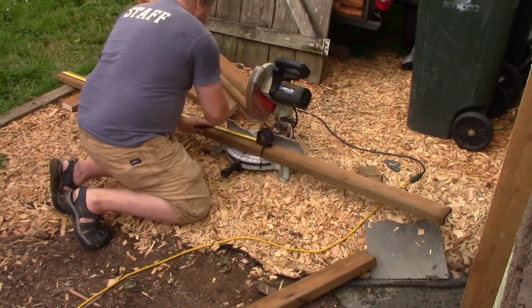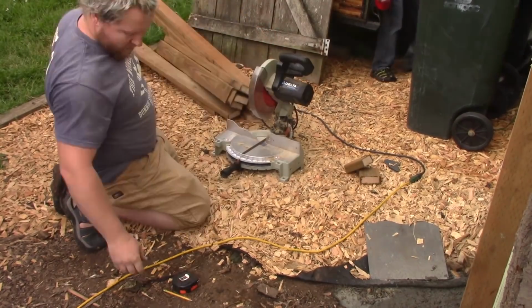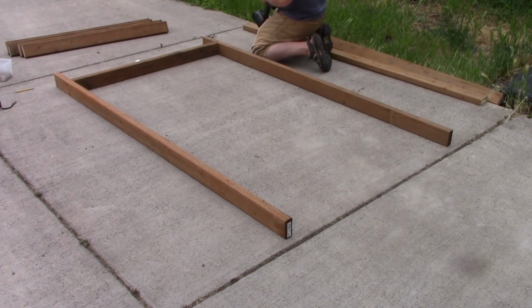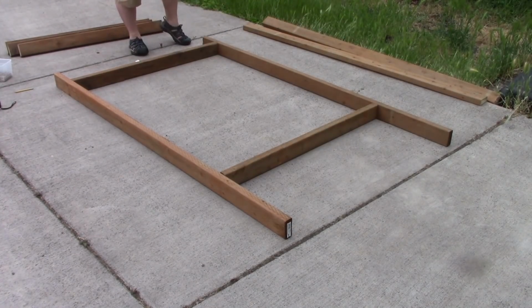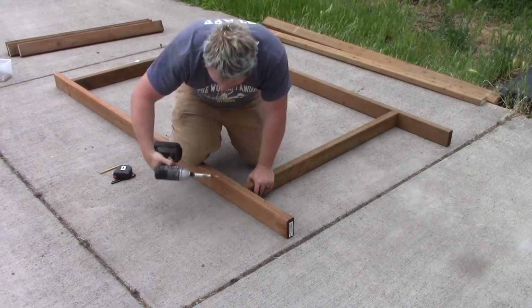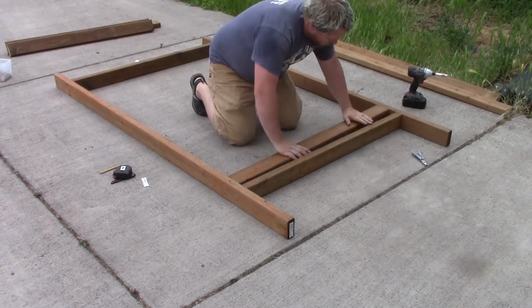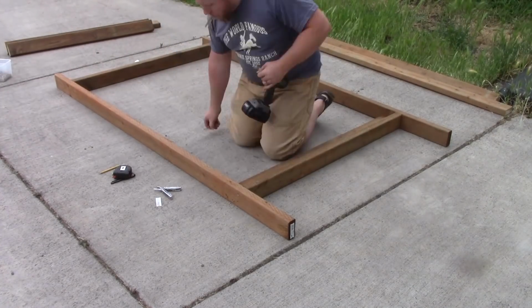There will be another 2 pieces to cut, but they are the cross pieces that will get figured out once the gates are mostly put together. Legally, most fences are only allowed to be 6 feet tall. That is a pretty common restriction across the country, and you should definitely check your local codes before building a new fence, because if someone turns you in, they will force you to remove the offending fence, which will likely make you very sad. Our plan is to leave the extra length on both the gates and the fence posts so that we can add removable extensions when we want them.